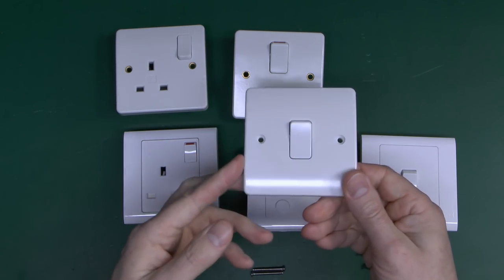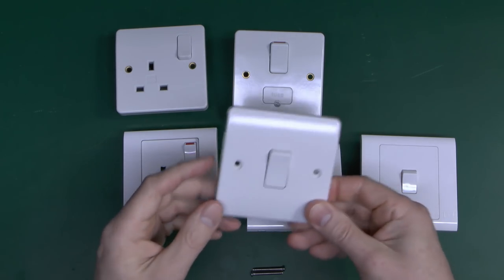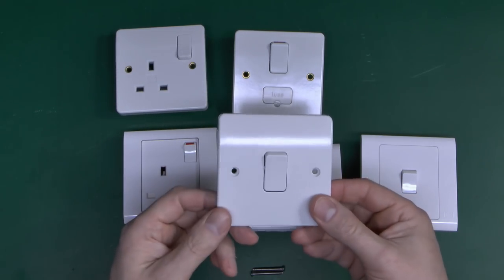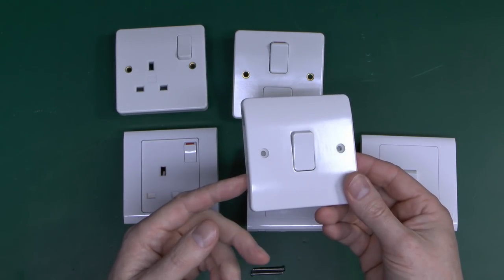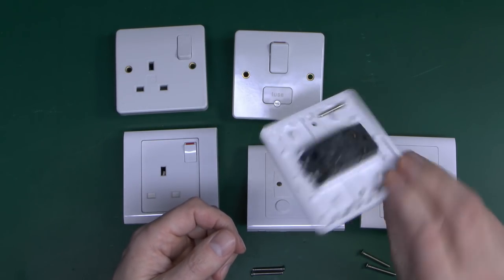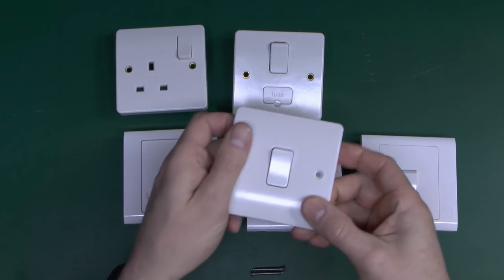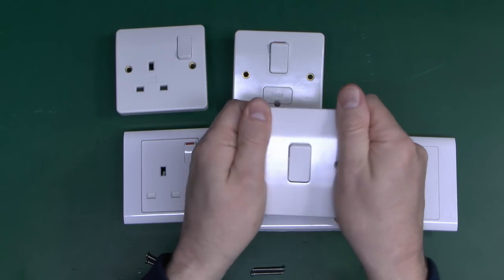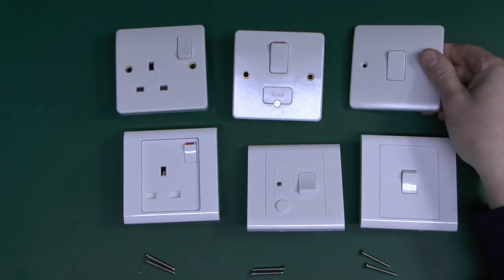The Logic Plus items are made from a hard and relatively brittle material — if you drop this on a concrete floor it's more than likely going to bust. It's some kind of urea formaldehyde material, similar to a Bakelite or phenolic resin. The key point is this is a thermoset plastic, which means that when it gets hot it doesn't melt and drip on the floor — it just goes a bit black and chars, and quite often smells of rotting fish. It's very rigid and doesn't bend or flex at all.